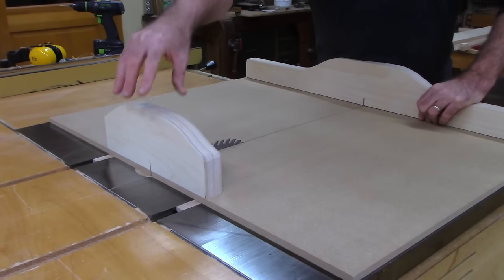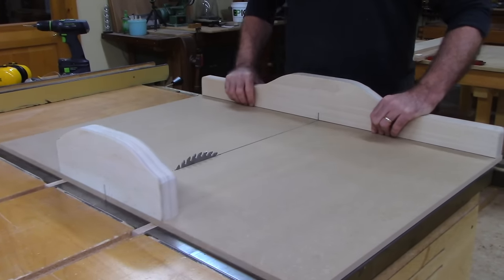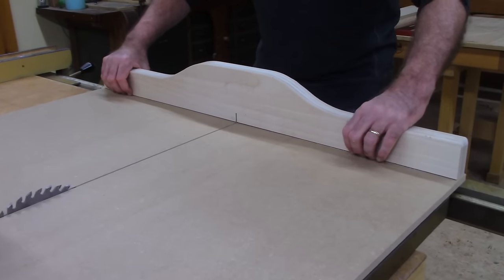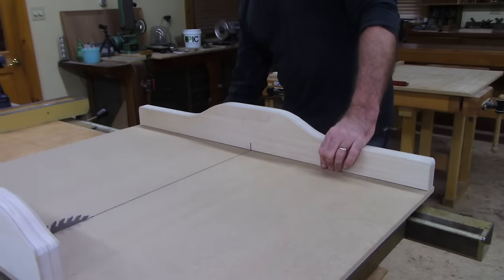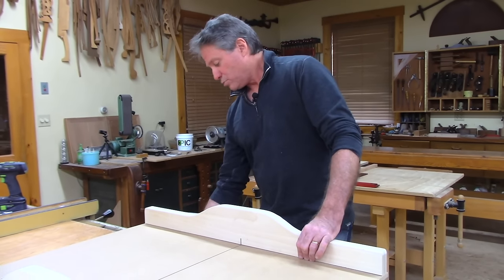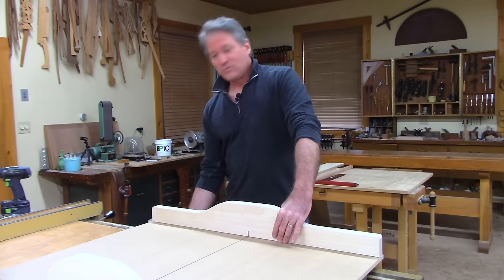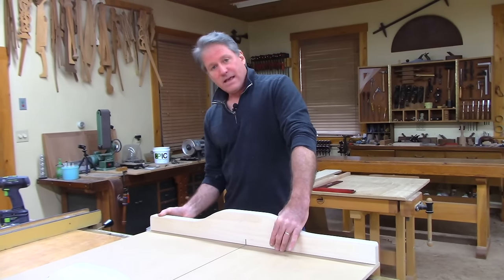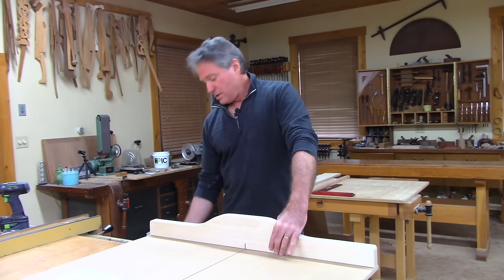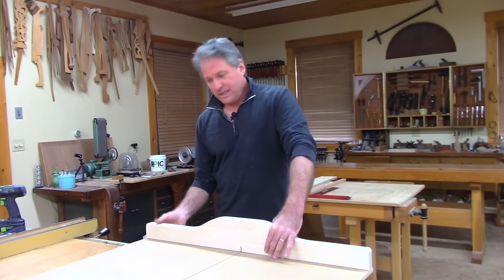That way I could attach the fences while it was still intact. We glued down and screwed the outward fence — this doesn't really need to be square, it just keeps it rigid from moving apart. Then the back fence is all just screwed on in the accurate position. To get it started, I ran a screw in from underneath, pre-drilled about an inch from the end, using a number 6 pre-drill countersink, then number 8 coarse-thread inch-and-five-eighths drywall screws to really suck it down accurately. I like that smaller pre-drill because it doesn't allow any movement when you run the screw back in. I also ran the screw in using a clamp to ensure it stayed tight.